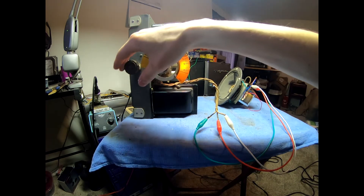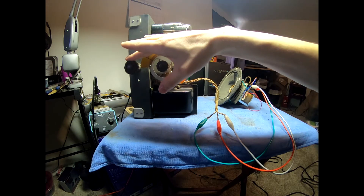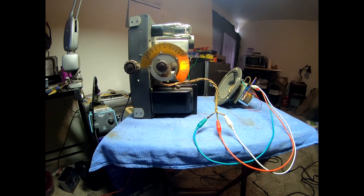It's worth noting that, like pretty much all early TRFs, the volume control is purely an attenuator on the antenna input — it doesn't actually control bias or anything to the tubes. It simply dumps the antenna signal straight to ground at the lowest point. Very basic. That was honestly more than I was hoping for. I haven't done all the adjustments on this set — I don't have the proper insulated screwdriver — probably get to that later. For now I need to finish cleaning up the cabinet and then we can reinstall the chassis, since doing the alignment doesn't require it to be out of the cabinet. That will be the next part, but I'm going to call the recapping and resistor replacement video done. See you in the next one — thank you for watching.